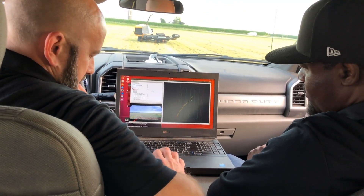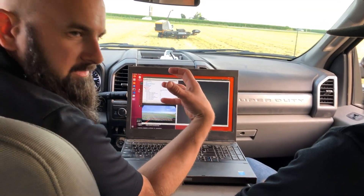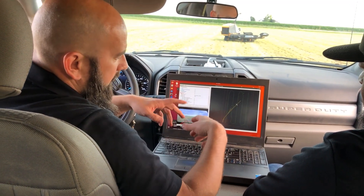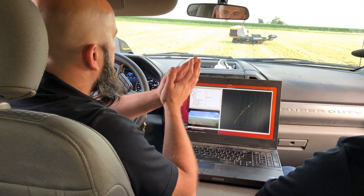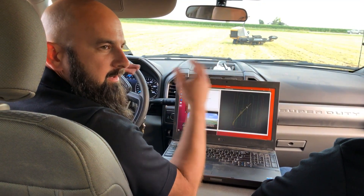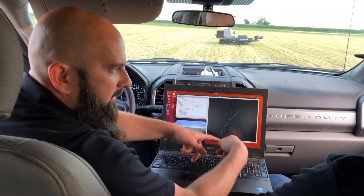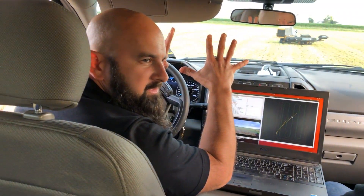The whole system requires 11 GPS points. You've got four GPS points to make what they call the work area — that's where you draw the zone you want your bales cleared from. If the machine detects a bale outside of that area, it ignores it. You've also got four or more points you can put in for a geofence, so if the machine reaches that boundary line, it stops the machine.